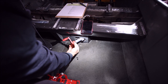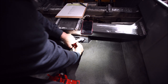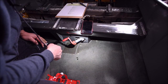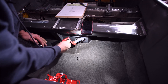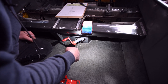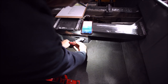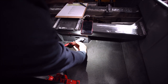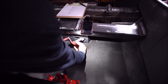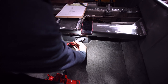We're going to look at the nut right here. If I hold my thumb there and use my fingernail to index the shaft on the gearbox, I'm going to turn this hand crank in the counterclockwise direction — that's the same as extending the gear using the hand crank. We turn it until it reaches the internal stop. I mark it with my thumbnail, turn the crank, and right there I hit the internal stop — that's a quarter turn. So this setup is good. We're right at a quarter turn, which is within spec.